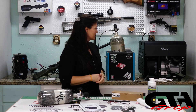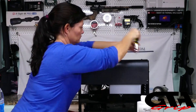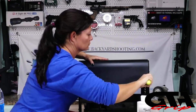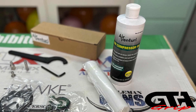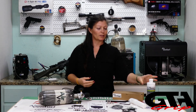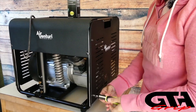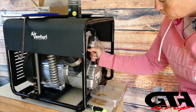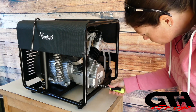It comes with the plug — you're going to need that for sure. For maintenance: check the water and make sure it stays at an appropriate level. Use distilled water only — anything else will cause gunk to build up in the tubes, clog it, and prevent proper cooling. You'll also need to change the oil; Air Venturi compressor oil is recommended, or any ISO 100 oil. The first oil change should be at one month or 25 hours, whichever comes first; after that, every three months or 50 hours.